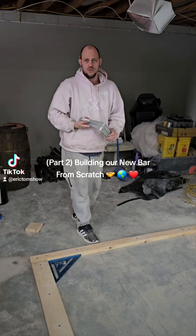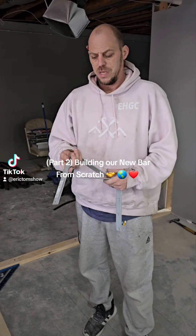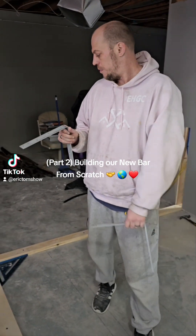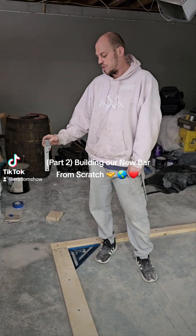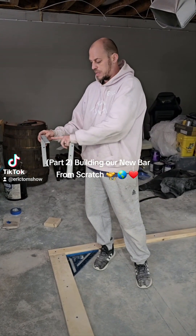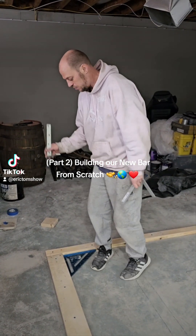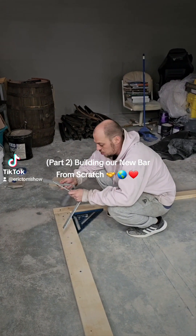These are super cool — everybody knows about them. Based on your dimensions they sell smaller ones, but the quarter-inch angle iron is definitely the way to go. As these walls shoot up, we're going to strengthen them several different ways. Hitting the two-by-six framework, and then underneath the actual top plate where the countertop is going to come in and rest, we're going to have several of these in place, down here as well, to make all this super strong.